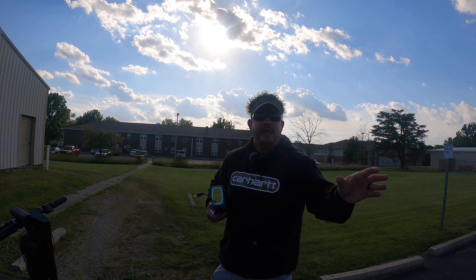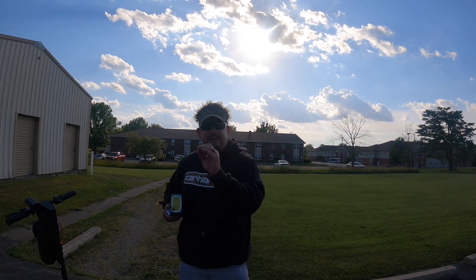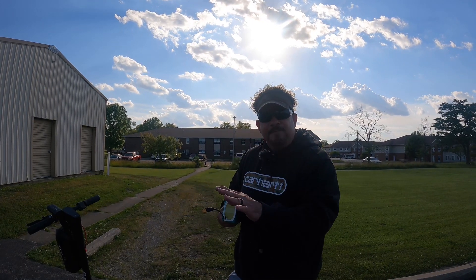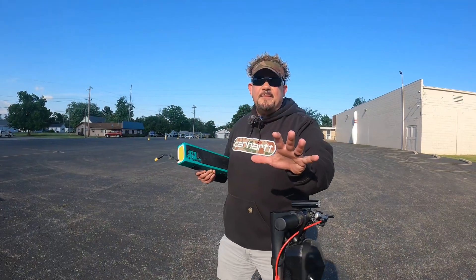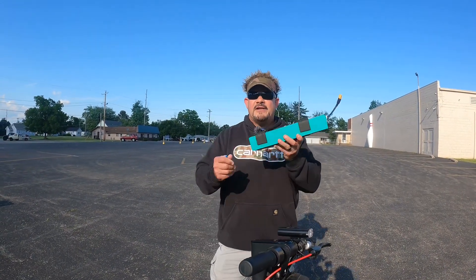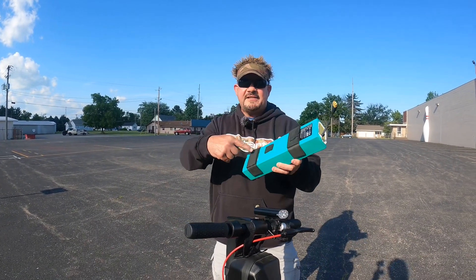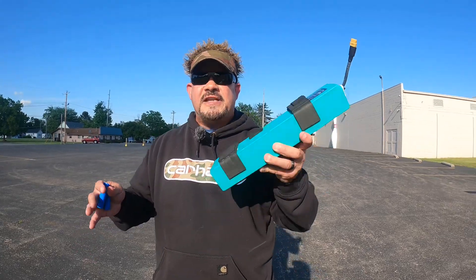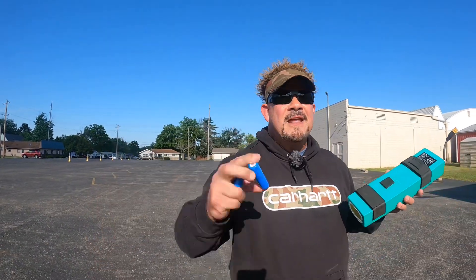If you're handy and want to DIY this, you'll need a soldering gun, duct tape, and a multimeter. If you're thinking of going to an electrician, keep in mind they charge around $150 an hour — so that's probably not the cheap solution you're looking for. You need someone who understands soldering and knows how to replace one of these cells, which only cost about two bucks.